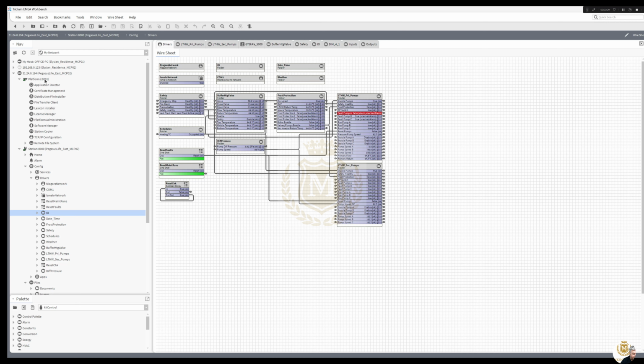The disadvantage is you've got to keep a spreadsheet, because you're never going to go in on 4911 or 5011 for the platform. You are going to go into your own port. The advantage of that is security. Anyone who knows Niagara, Tridium, knows the standard port's 4911 or 1911. So I'll come to site, not my job. I want to get in there, as long as I know the username and password, which the client would normally tell them, because it's in the documentation.